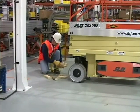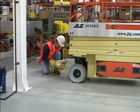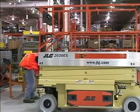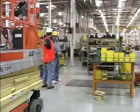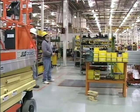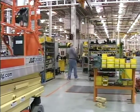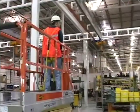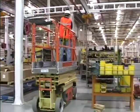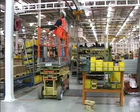Precautions to avoid all hazards in the work area must be taken by the user before operation of the machine. Do not operate the machine in hazardous environments unless approved for that purpose by JLG. Before operation, check the work area for any overhead hazards such as electrical lines, bridge cranes, and other potential overhead obstructions. Ensure that operators of other overhead and floor-level machines are aware of the aerial platform's presence. Disconnect power to the overhead cranes and electrical lines. Barricade floor areas if necessary.